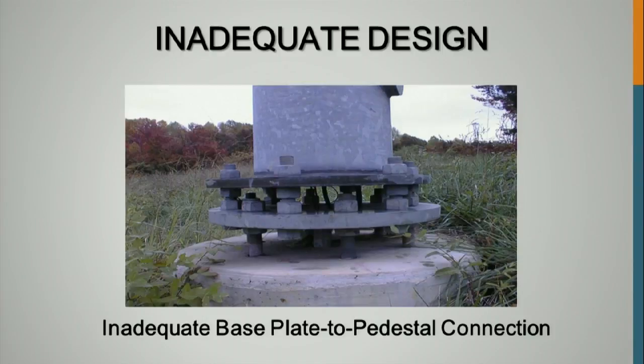Here is, as Jerry likes to say, they built the road too high, so they just put one more base plate in there. Something like this, there's no way anybody could tension every one of those bolts. It'd be a pretty big accomplishment. The base plate template was incorrect, off by 45 degrees, so this was their solution to put the sign right. You could probably just take off the base plate and re-weld it. Would probably be easier. Something like this is going to become loose. Has a lot of moving parts.